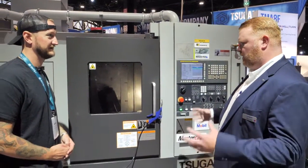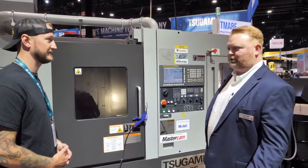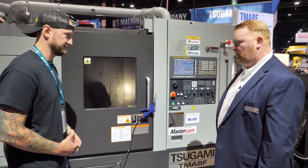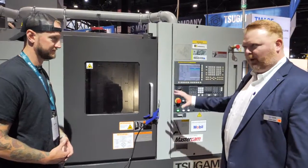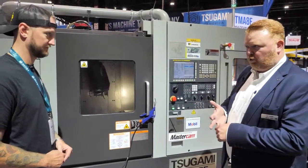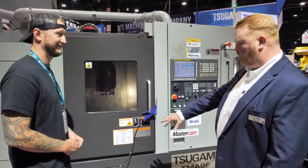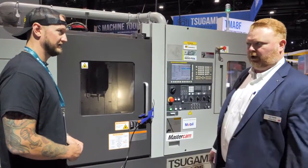This is a fantastic machine — one of our higher-end units for bigger parts. It does come with a Renishaw system. Typically we include the Renishaw system in the quote because customers using this machine are typically doing intricate work with small tools. The Renishaw non-contact system checks with a laser to make sure the tool is still there and not broken so we don't miss features on the part. We also use a Renishaw spindle-mounted probe to check features on the part in-process.